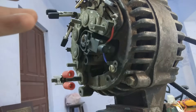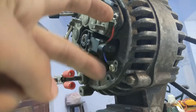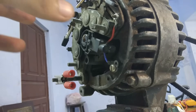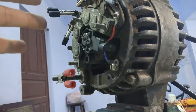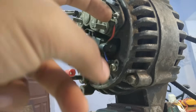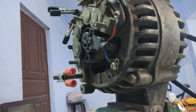The first step will be: for a moment I will feed electricity to these terminals — the red and the blue — which are connected to the brushes, which will in turn excite the rotor. That rotor will induce EMF in the armature, and then the armature will generate current which will feed electricity back to the brushes, and the brushes will again excite the rotor. The cycle will keep going, so after the motor gets into that cycle we can remove the connected energy source and the alternator will still continue to produce electricity. This process is self-excitation.